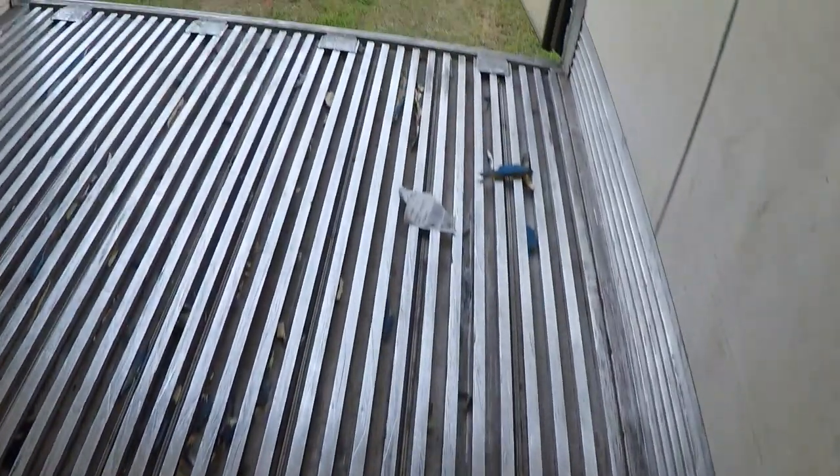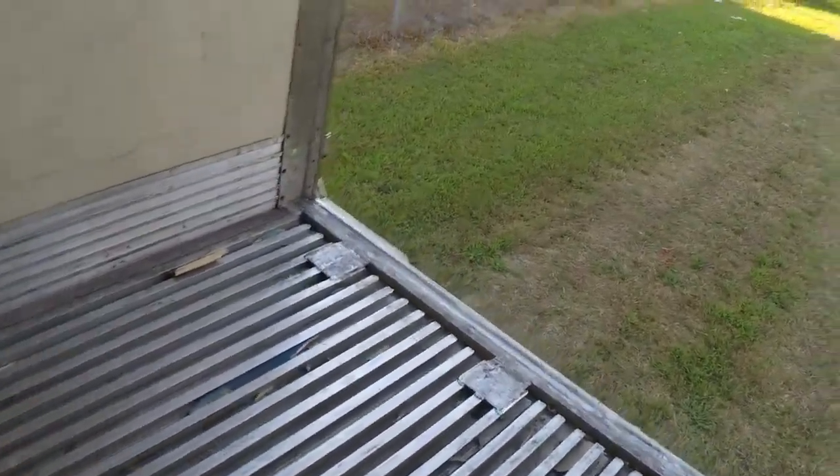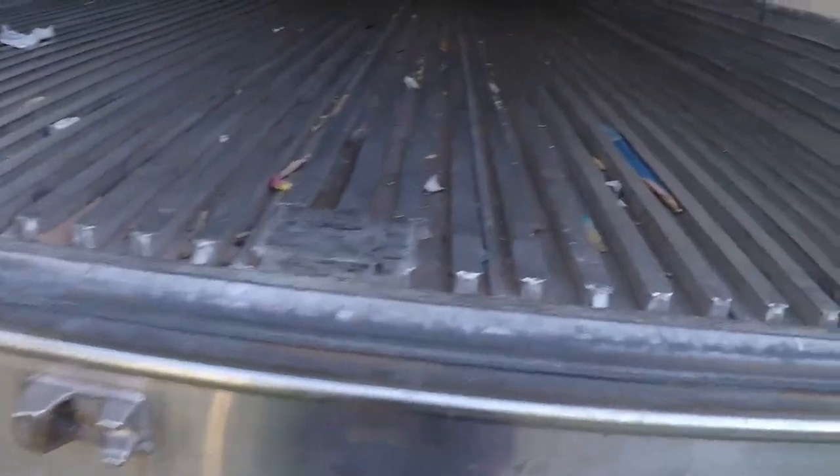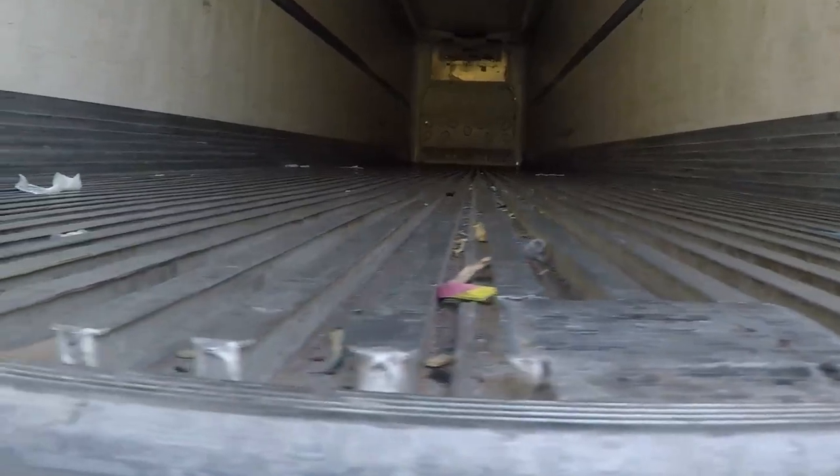Check your floor — if you have any holes, you want to get them welded up quickly. Underneath some of these older trailers it's all wood; newer trailers use composite backing underneath the floor so they don't rot out. I think around 2012 is when they started going to composite floors. Get down and look at the floor and make sure it doesn't have any dips or bows. The biggest deal back here is these plates around this area like to crack, so look at those areas really carefully.